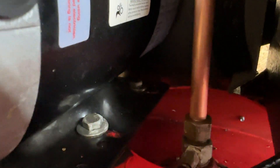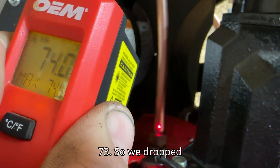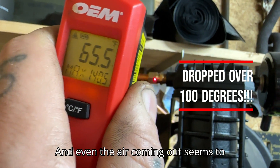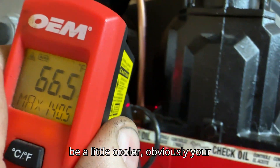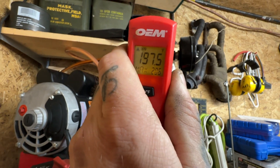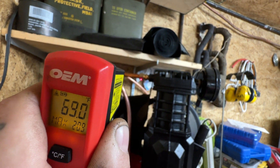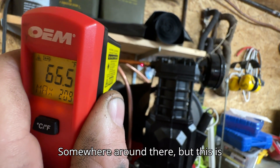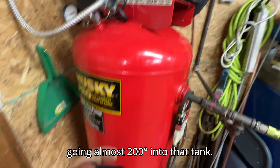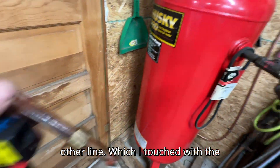She got up so high — no leaks. What's our temp? 73. So we dropped that and cut the temp in half. Even the air coming out seems a little cooler. The cylinder was around 200 degrees, but the air coming out is only 65-70, about 72-71 somewhere around there. Key thing: 75 degrees going into the tank. We were going almost 200 degrees into that tank before, and now you could actually touch that line without hurting yourself.